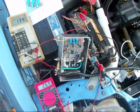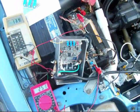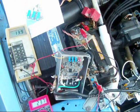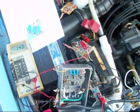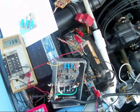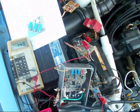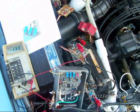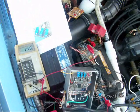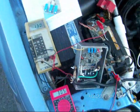It's really that simple. You connect up the unit, start up your engine, see if you're pulling any current, place the short or jumper on the current limit override, add your electrolyte until you get your peak current that you want, then remove the current override shunt and adjust your current limit to whatever you want — in this case, mine is about 30 amps.